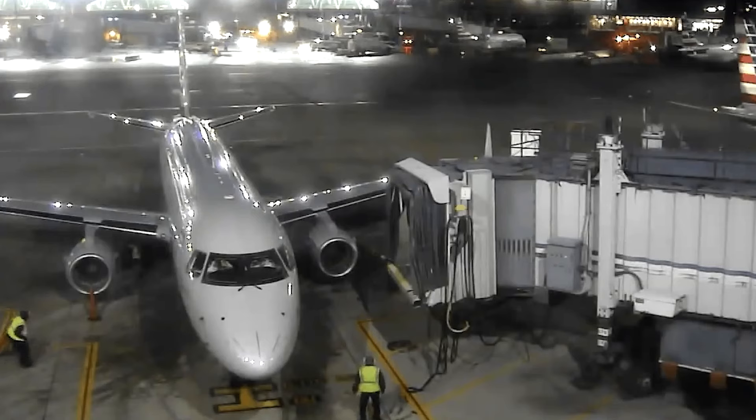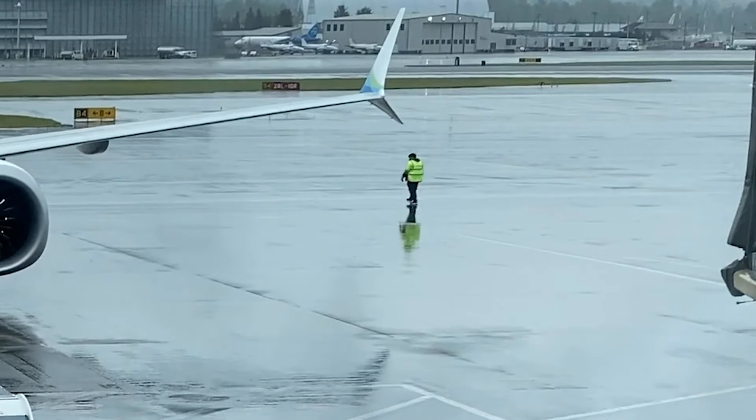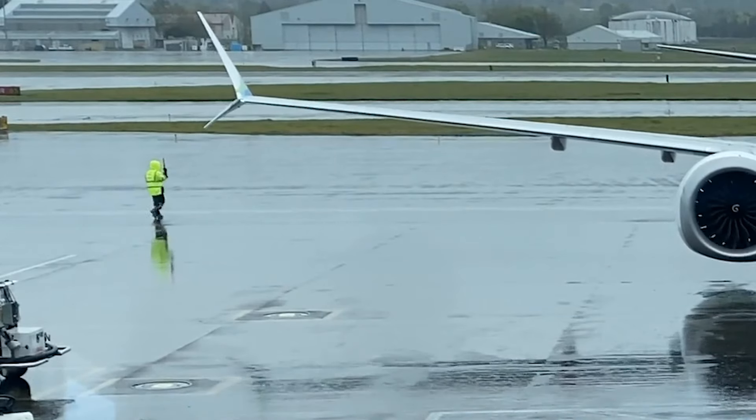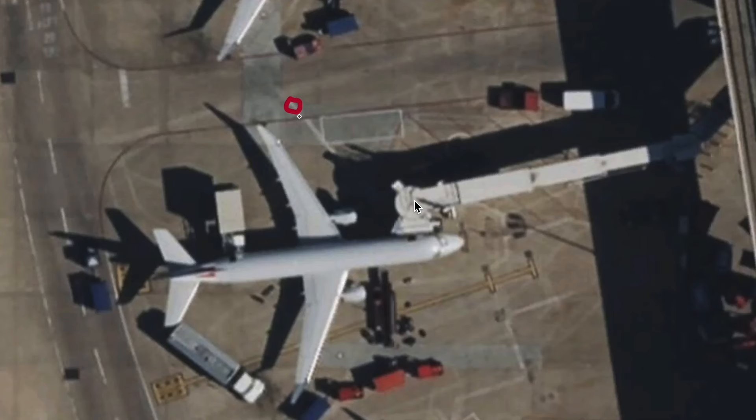This old video shows a cone being sucked in with an engine at idle — the guy there was extremely lucky. In the case of an E-175 pulling up with an inoperable APU, there will be wing walkers on each wing, again at a safe distance. Often the wing walkers will have other duties like baggage handling and will switch to those duties once the wing walking is complete and the airplane is parked. The baggage for the E-175 is on the right side of the plane. For a wing walker transitioning to baggage duty, the shortest distance would be from the wing tip on the left side, along the wing, under the fuselage to the right side baggage.